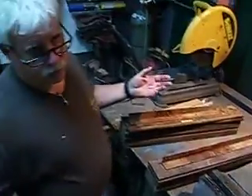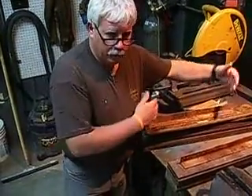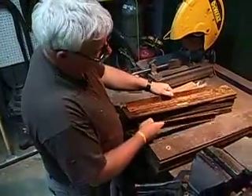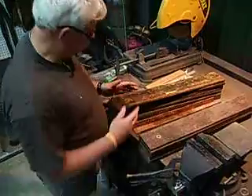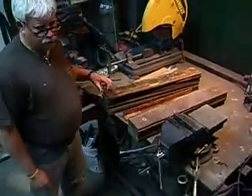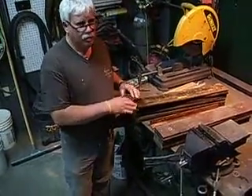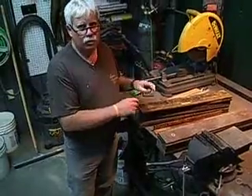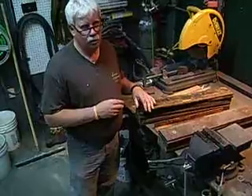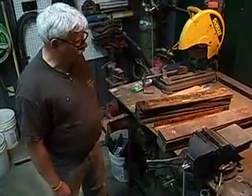We're actually going to use stainless steel angle irons for part of the repair, and we're going to extend them a couple feet longer so that we can put these weights back on them. The weights are steel and not stainless, so we're going to clean them up and paint them real good. They were actually all rusted together — we just don't want to introduce rust. Where you've got steel oxidizing and you get that rust on the wood and in the wood, it actually helps start the rotting process in the wood for some reason.